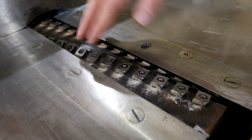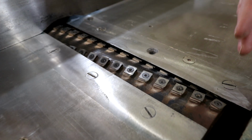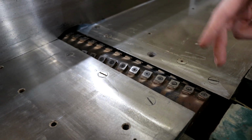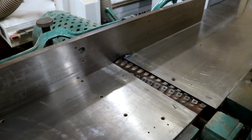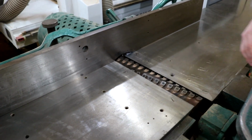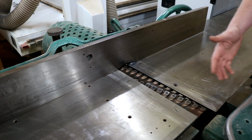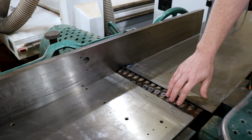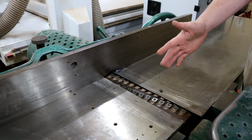It has a bunch. But what's really cool is on a 16-inch joiner, I can still get all 16-inch joint if I had to from corner to corner on this. A lot of other helical heads, they cut corners on that, and so you get a helical head and you'll get something more like 15.5 or 15.75. And this was something that was put into consideration in the design that we talked about with Byrd Tool. And so that was something that was really cool.